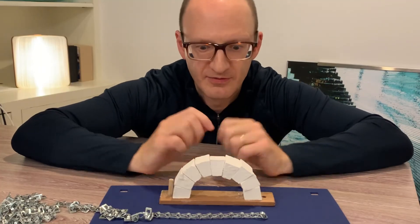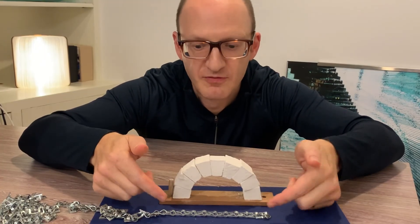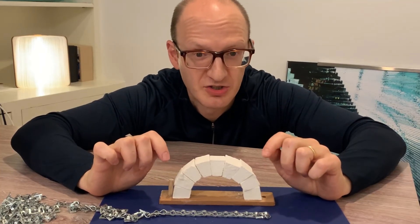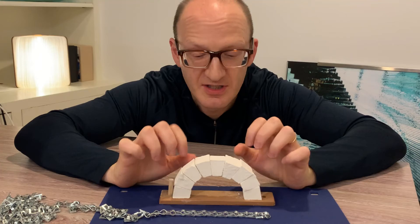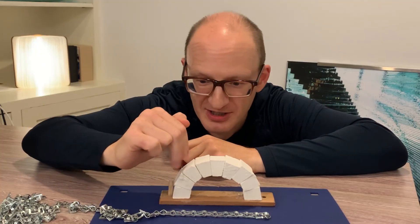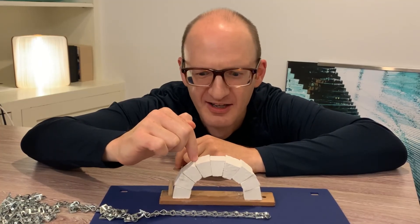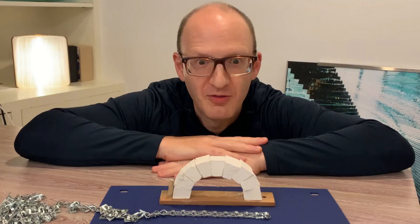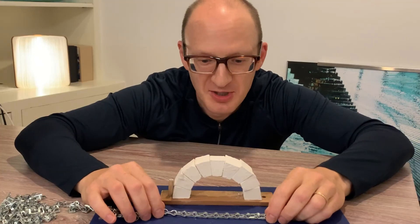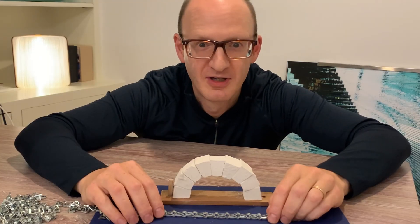So in summary: tension in the cable is the same as, but in reversed shape to, compression in an arch. And if that compression line in an arch — which we call a thrust line — leaves the arch itself, you can cause instability and failure of an arch. So if you're ever walking across an arch bridge, don't worry about trying to get to the middle. You've got to get past that little quarter point. If you do that, then you'd probably be fine. That is how arches work. If you like these explanations about cables and arches, click like and subscribe, and you'll see all the other videos I'm going to be posting about how structures behave.